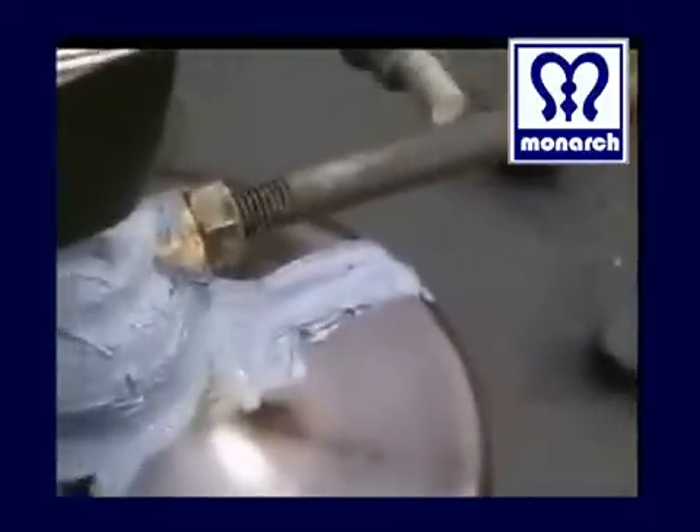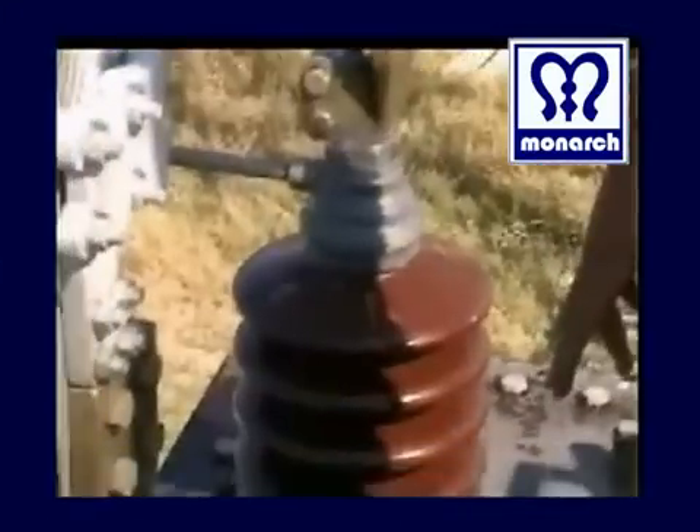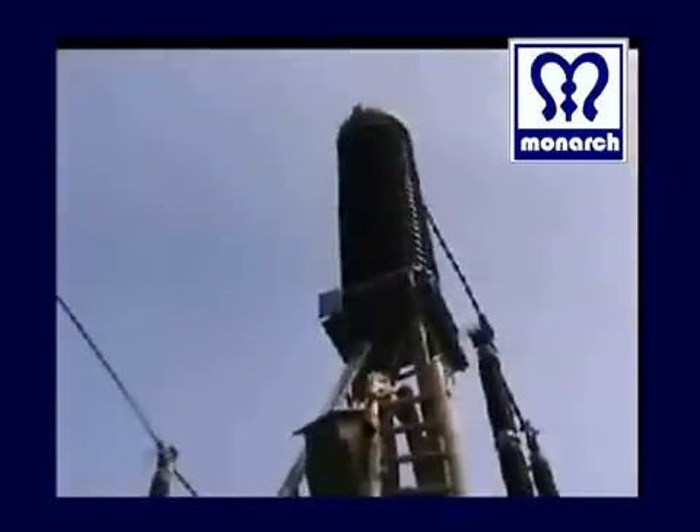Oil leaking in a transformer may occur from both the bushing, flange, and fastener areas. Leaks due to oil penetration through bolts and threaded connections, flange gasket failures of top and bottom cover of transformer lids, bushing leaks through the base mounting flanges, through drain plugs, inline tap changers, and level dial gauges.